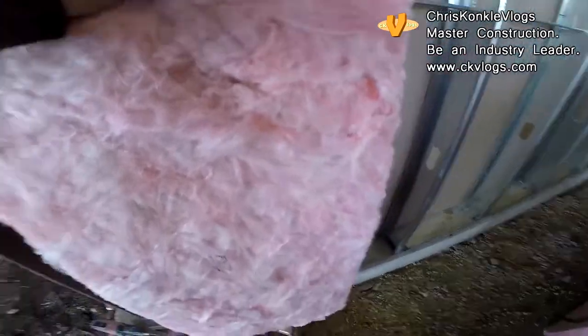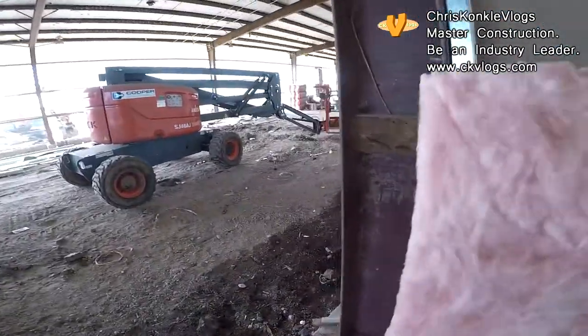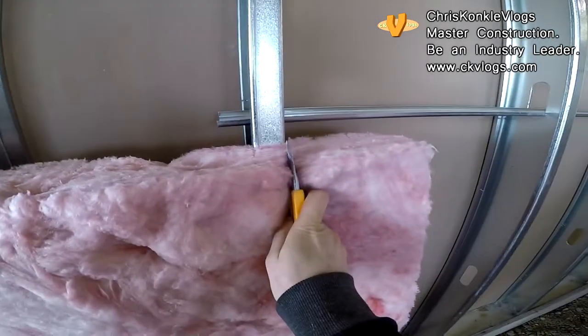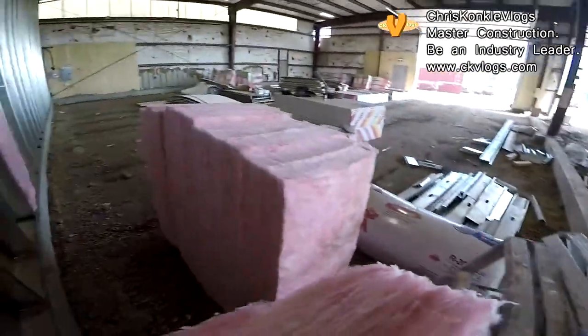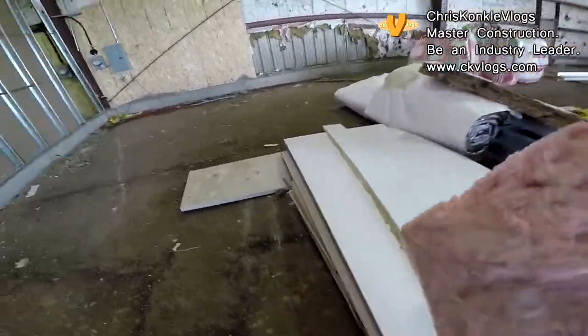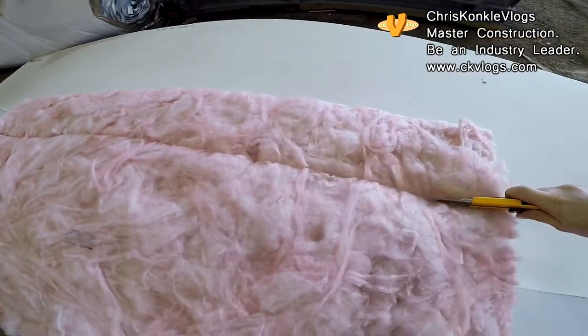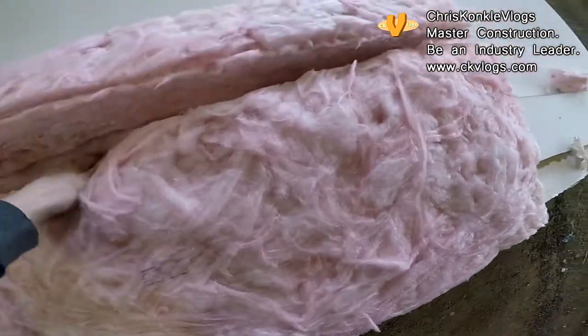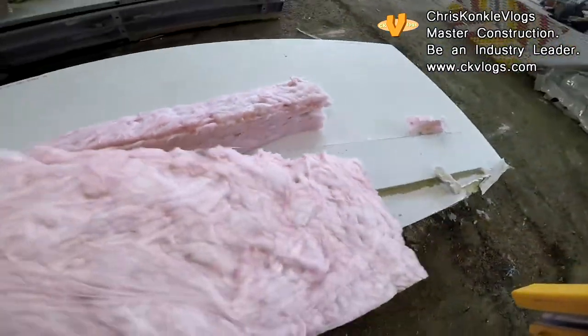You never use a tape measure when you're insulating. All you do is go up to the piece you need to cut with your knife, line it up, make your mark where you've got to cut it, and cut it — simple as that. You'll need more than one, so all the ones on that side will be the same — just freehand it.